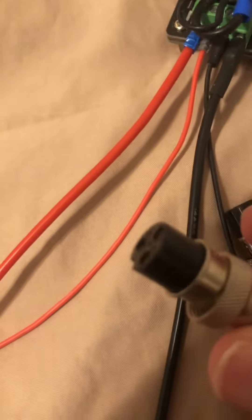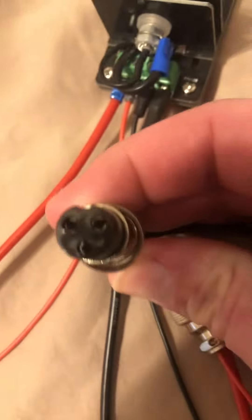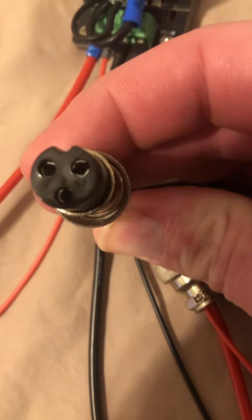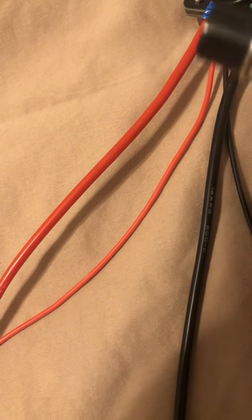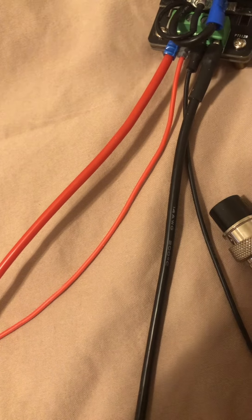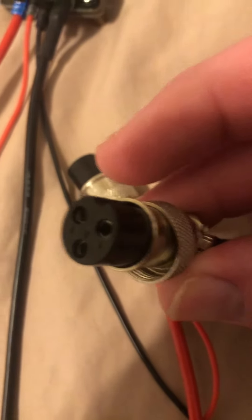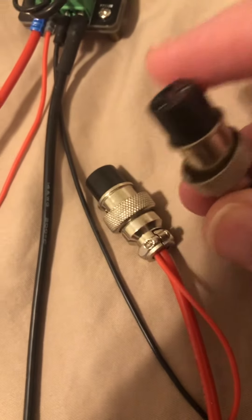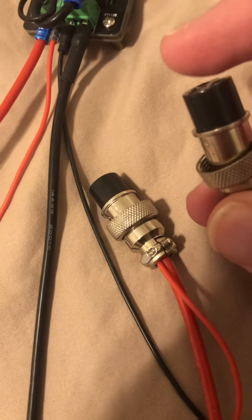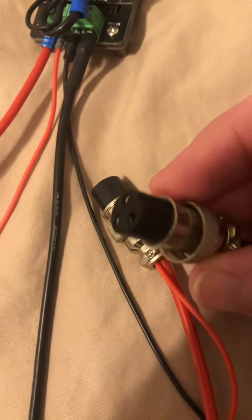If you want this to interface with something like your EBC A20, the top two pins are current and the bottom one is voltage. I might have gotten that wrong — open up the ones that come with your tester and you'll figure it out. You split the thick wire to go to two pins, and the voltage sense just goes to one pin. That's how the stock EBC GX16 connectors are wired up.